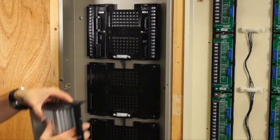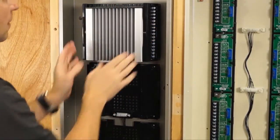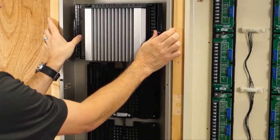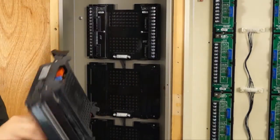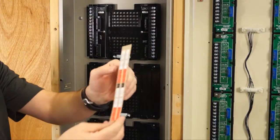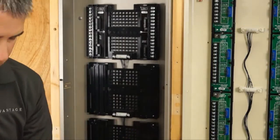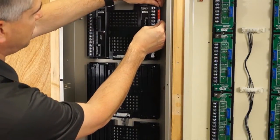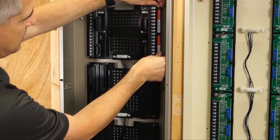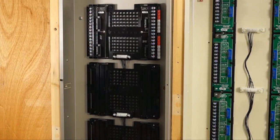Now the new standard dimming module can plug into its position, lock it down, and it's installed. By pressing out on the sides, it will eject itself out of the box. The labels are there to help you see your wiring — they can be there for the electrician when he's installing, so he can see his line feeds, his loads, and his neutrals. Those go on both sides.